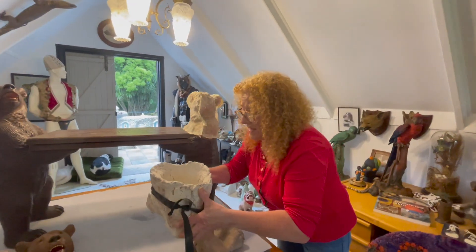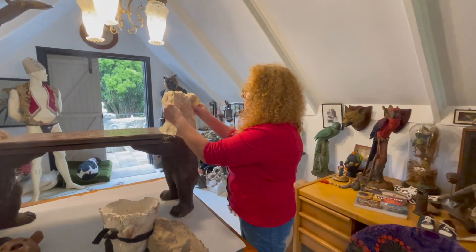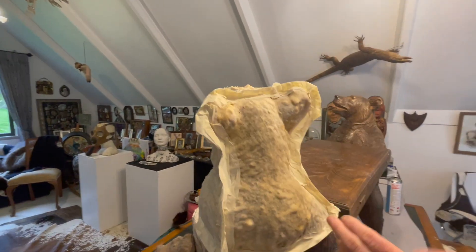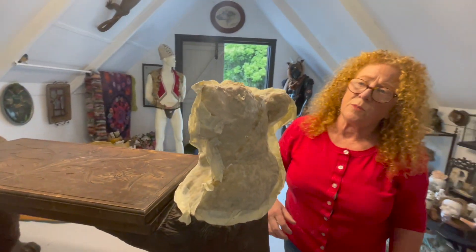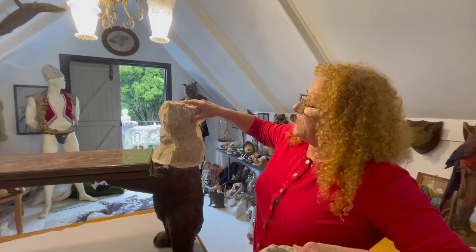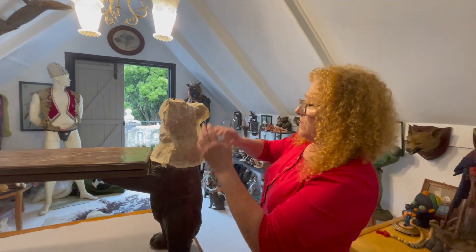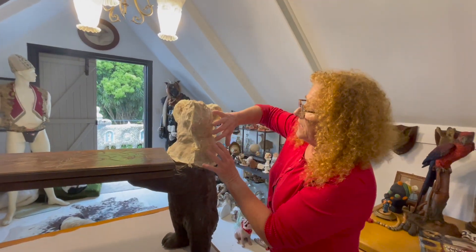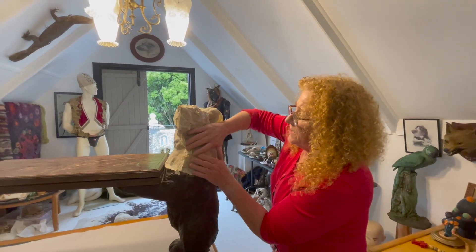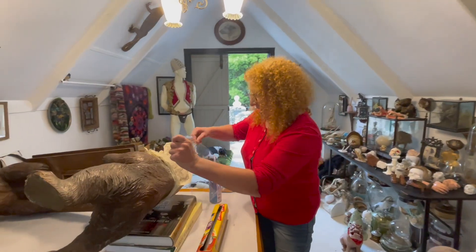This plaster is already quite heavy, and when you fill it with cement it's even heavier — so a lighter expanding foam mother mould is a good thing to do. I've already done my divisions — it's a three-piece mould. Come around the back here — you're going for the highest point, the tip of the ears and the very extension of his shoulders, just to support it. The best support you're going to aim for is the face. We're going to put a piece of glad wrap on every part here because the expanding foam goes off in about five minutes.